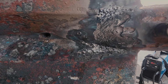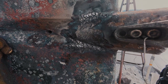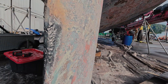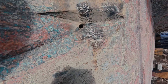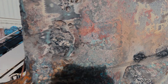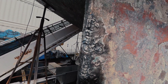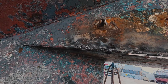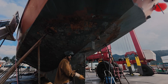Done a few passes now and here's what it looks like — one root pass of 6010 and then a couple passes with 6011. I know it's kind of ugly, but I'm just trying to keep moving and get the metal in there. It's not like I'm going to achieve a high-gloss ultra-smooth yachty finish anyway. Mostly it's just about thickening up the thin spots and replacing the welds where the electrolysis had really melted it out.